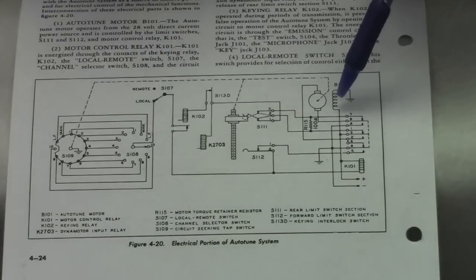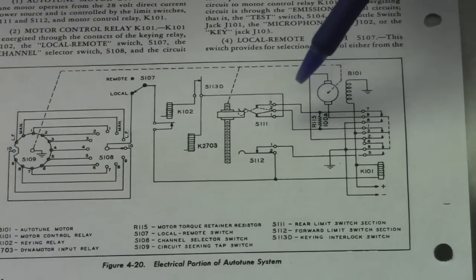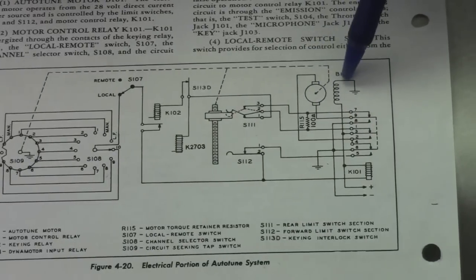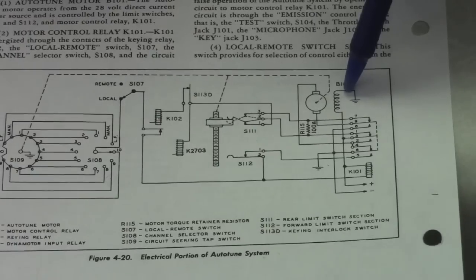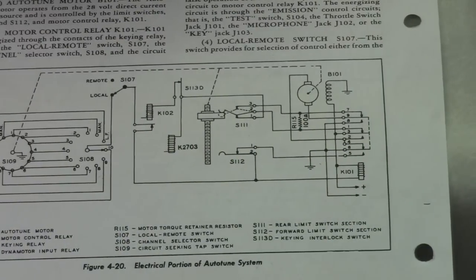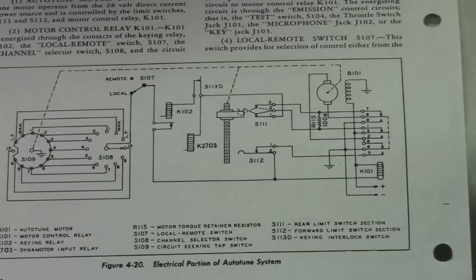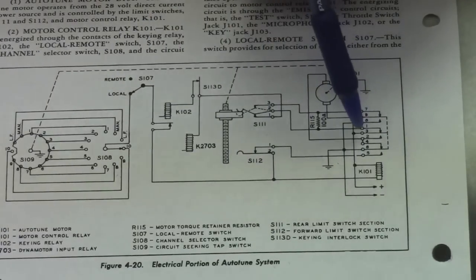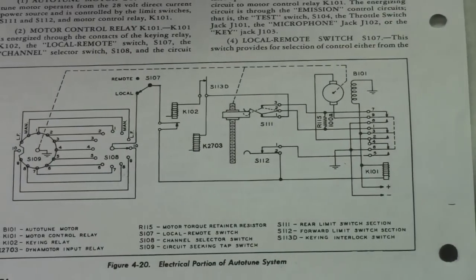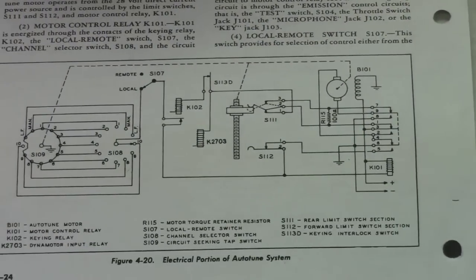And some of the hams have gotten off, and I've seen literature where they've said, oh, we can put a couple of diodes and so forth. Don't ever do that. If that motor coasts beyond its reversal, it'll never find it. When the motor is reversing, all of a sudden it coasts. When that relay relaxes, that motor's got to freeze. And then the polarity of the motor is changed, so the motor reverses in the opposite direction. That's the most critical point.